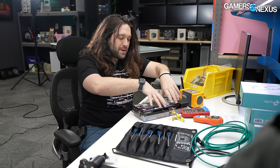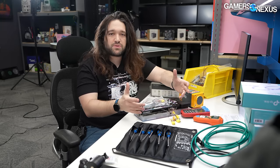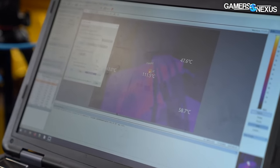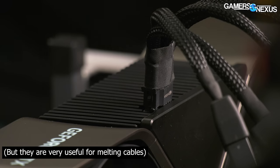It blends some normal video card design with something unique without going too overboard. Let's get started with some testing, starting with thermals. For thermal testing, we first do a pass without ever disassembling it - straight out of the box, no interference, no thermocouples installed. Then we pull it apart and attach K-type thermocouples, which are calibrated so we know the difference between all of them. You could use a thermal camera, but these have limitations - you'd have to alter the card to get a meaningful read, and it doesn't show the front side because there's a cooler attached.